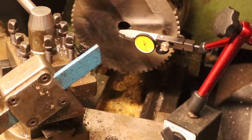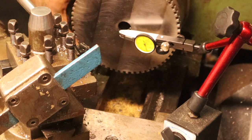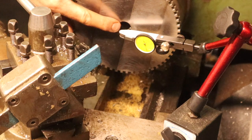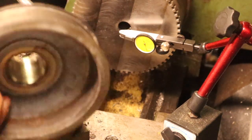I now got it centered - it's within about one-hundredth of a millimeter. It's very well centered. I'm happy with that. So now I can move forward and start cutting out the center of this so that it will fit onto my balancer.